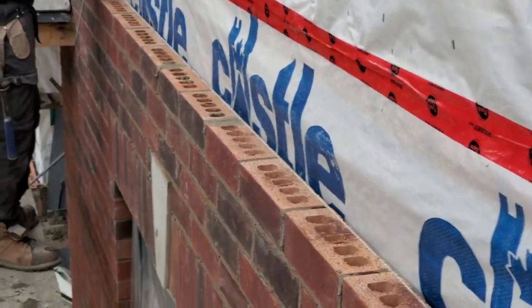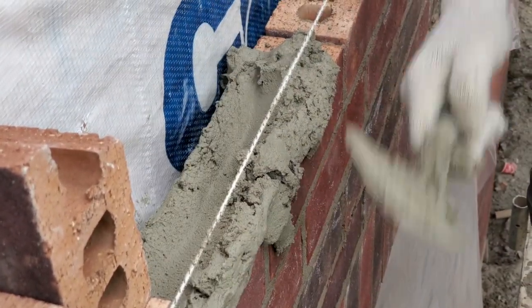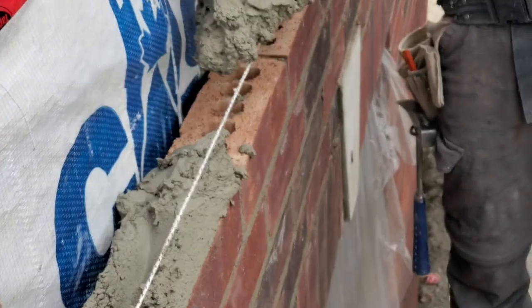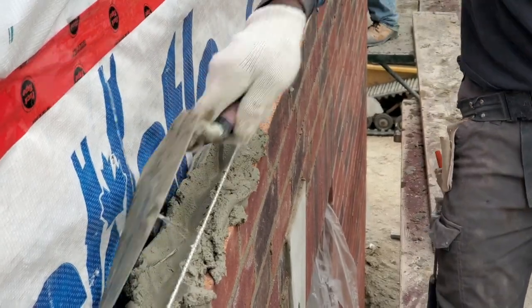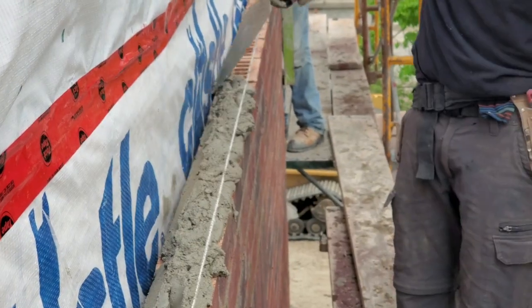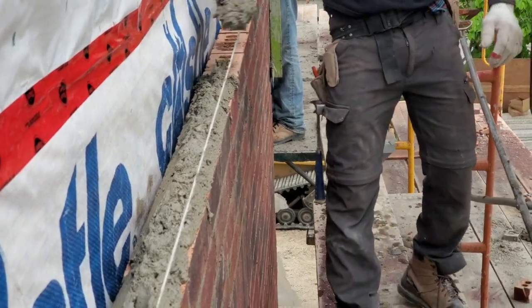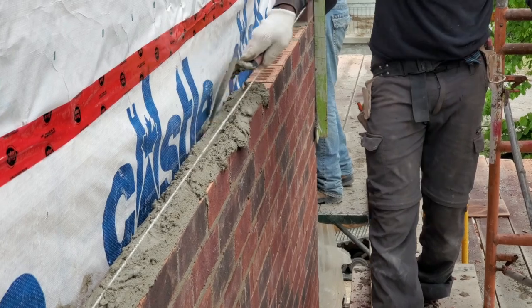That'll get there. Okay, so, we have a few different ways. One way I like to spread my mortar, I like to go down like that, shake off a little bit. Clear. And then I'm going to show you another way. And I'm going to speed up. Whichever, you can try both ways and see whichever one works best for you. Clear your cavity as you go.